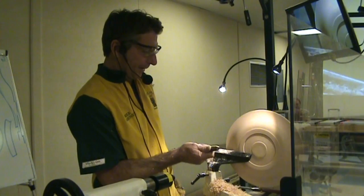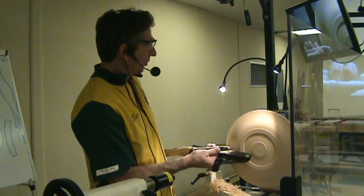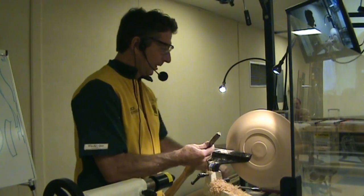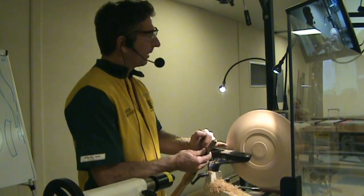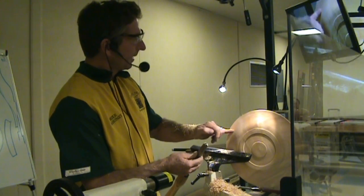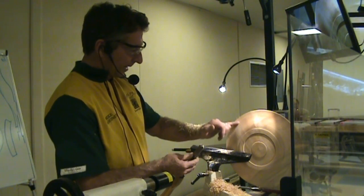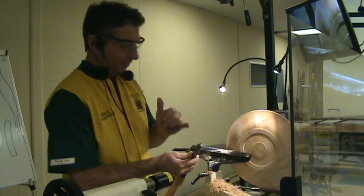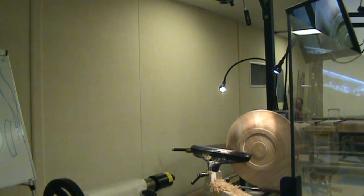It's not scraping the surface. People have a tendency to put this tool in their hip at a horizontal plane to touch the wood. But I take it and tilt it up so it peels at the wood. Hopefully that surface is now cut a lot cleaner. There's still some broken surface there — that's where my walnut oil would come in nicely. I'd lubricate that surface and then cut over it. I'm going to sharpen this tool and then go over it — that's always the first thing to do.